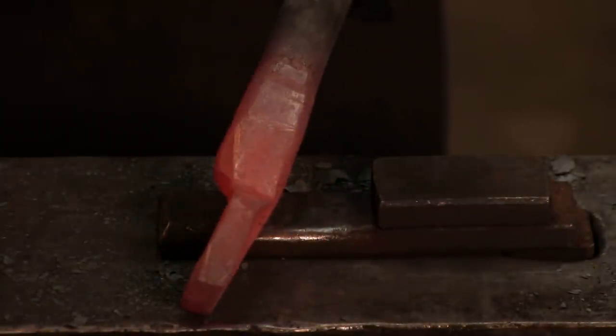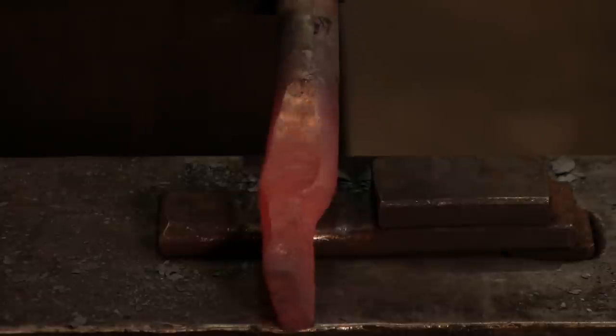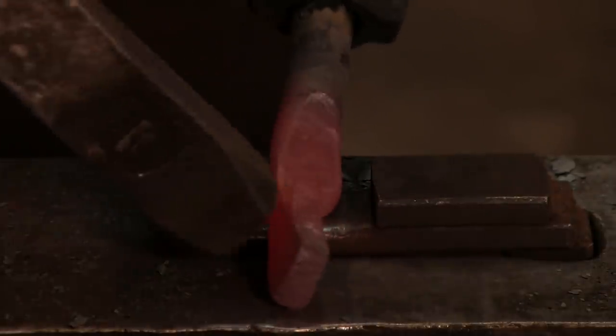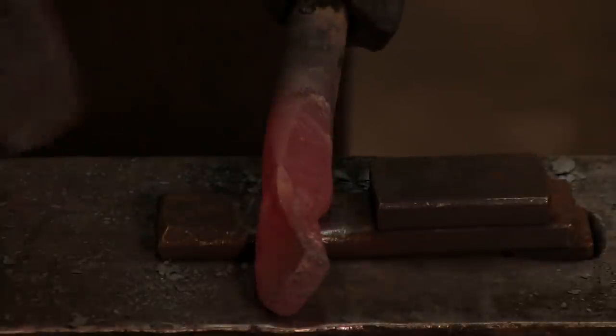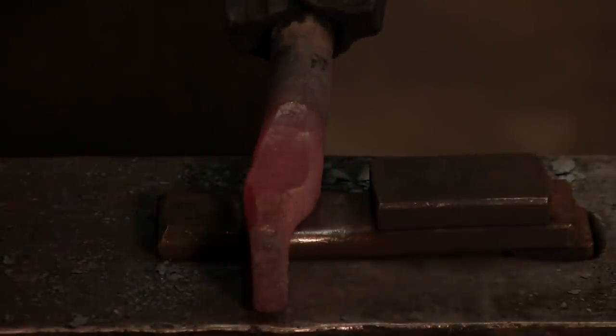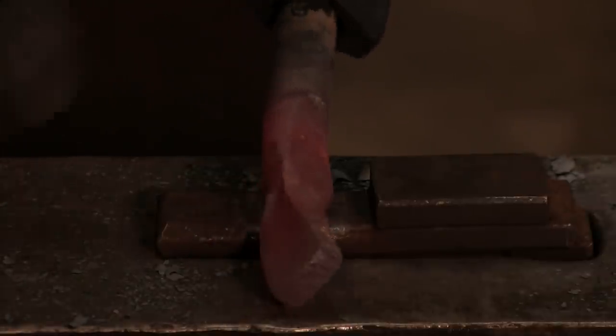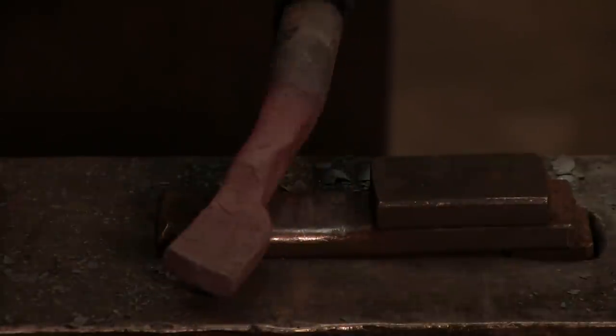But you can very clearly see that now we're getting something that looks like a boss. Now, you did see me actually turn this up and kind of have to give it a couple smacks this way, because this guy's going to have a tendency to want to twist just a little bit. So by coming in and making those corrective deals, I am keeping it in line.